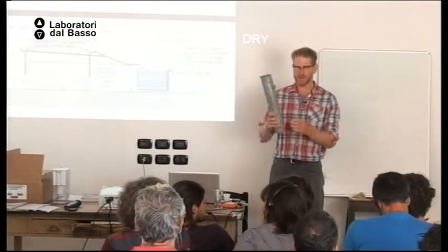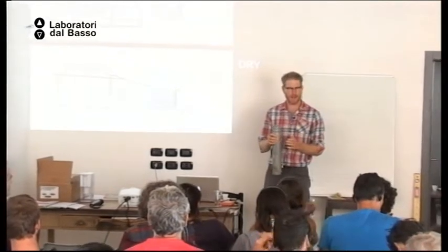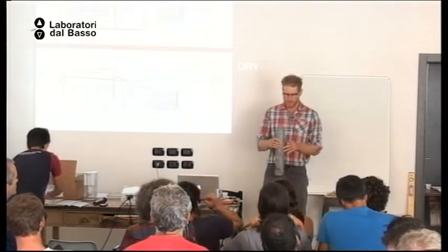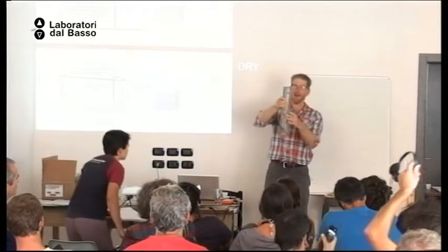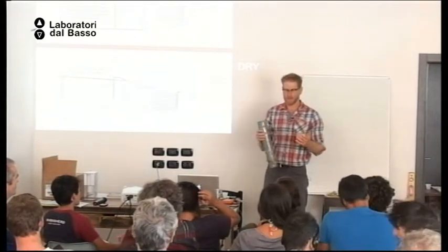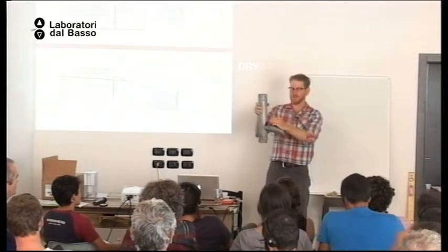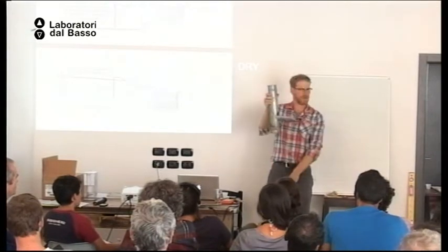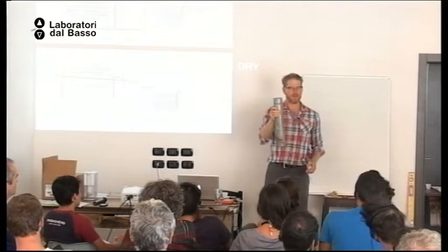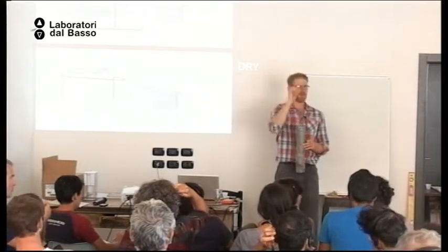So Ben shared this with me, and apparently this is very easily available locally. It's a local version of the first flush. The water all goes down the pipe from the gutter to the cistern. But if you are here when it rains, you can pull it out so that the first flush of water will not go to the tank. After you let the dirty water flow, you can close it up and the water goes to the tank. You have to do it under the water. Yeah, it's under the gutter. When it's raining. Yeah.